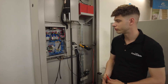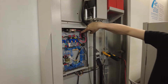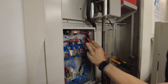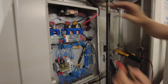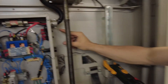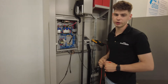Once we confirm that the main fuse has voltage on both sides, the next voltage point on our circuit is our primary 4-amp breaker. The voltage is coming from there, and we're going to test the top pin of that breaker. You should be able to just slightly touch the metal terminal and get the voltage you need. This voltage needs to be the same on both pins of the breaker. Once you've got the top wire, you can verify the lower terminal — which is 24 as well. If the breaker were to be popped out, that means it's deactivated, so you need to push it in so they'd be flush for it to be in the on position.